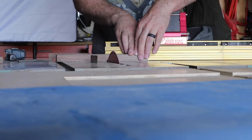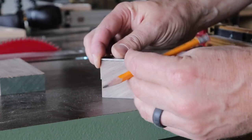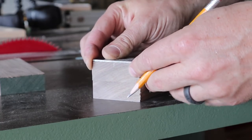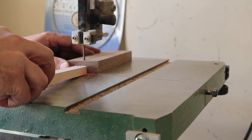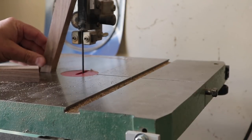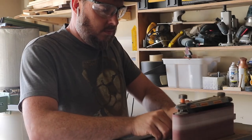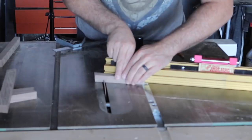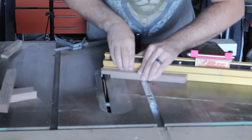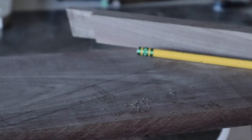Each piece actually yields two legs, and I started by cutting the tops and bottoms of the pieces at 15 degrees, then making my marks to lay out the tapered line on each of the leg sets. Ideally I'd make these cuts on my table saw with a proper tapering jig, but because of the size, it was way easier and safer to cut these on the band saw and then come back to my sanding station and finish everything up to the line. To mimic the look of the legs of the Bad Larry, I took the time to make half-lap joints for the legs and stretcher assemblies, which cross in an X pattern on the underside of the box. I used my two pieces, just like Chris did in his video about the Bad Larry, to mark out what I needed to notch out and the angle I needed to notch it out at.